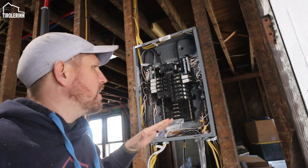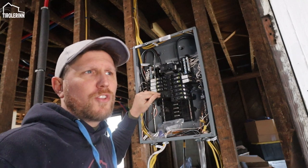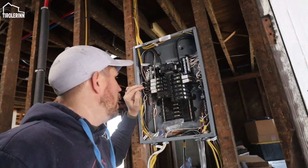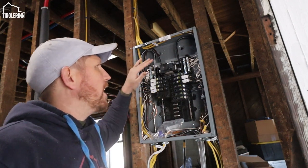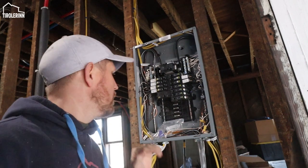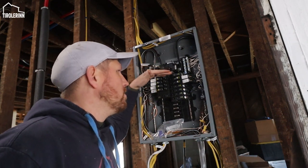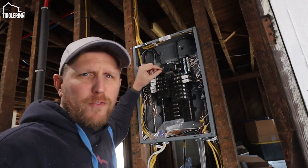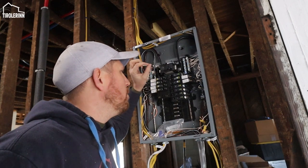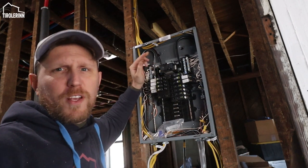We have a few different types of breakers. We have double breakers, of course, for higher voltage and higher amperage appliances that need a red and a black wire going to them, which would be the range or the dryer. So those are double ones. And then on the singles, we always have 15 or 20 amp ones, where most of ours are 15 amp in most of the floors, besides here in the first floor with the kitchen.